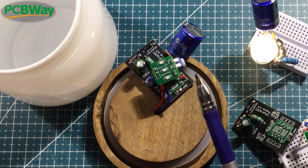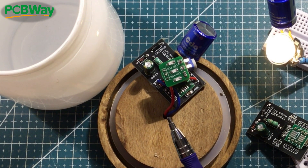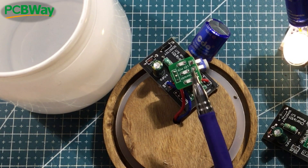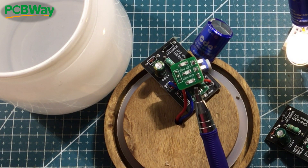So I think I'll go back to the 2.7 volt versions, or indeed back to nickel metal hydride, until I can work out some way of making these two talk to each other. I've been looking at voltage doubling circuits and all sorts of weird and wonderful things. But in the meantime, I'll just package up this version of the project, which has these three separated LEDs.